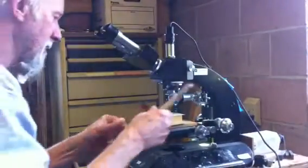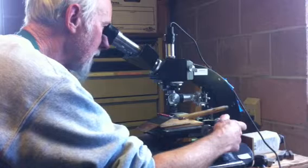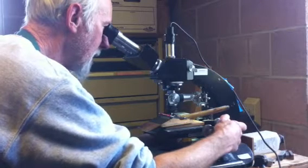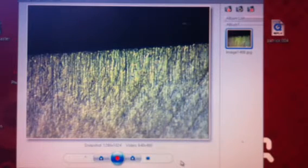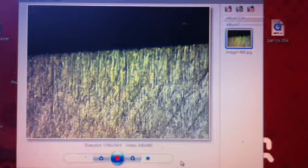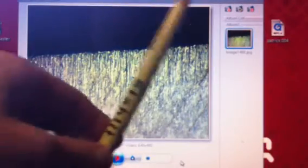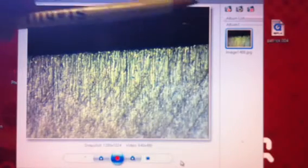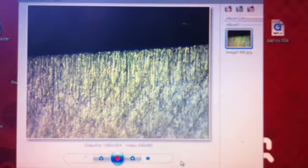Okay, you remember what the edge looked like before we jointed it, and the false edge. And then after the jointing, there was still the heavy scratch pattern from the 2000 grit. Now, with about 15 strokes, here's what we're seeing now. We have a grit pattern that's based on the Japanese natural slurry right along there. You can see what's left of a few diagonal strokes from the 2000 grit King, but they're pretty much gone. And that false edge is all gone now too.